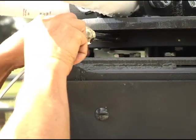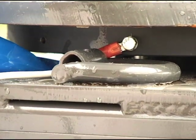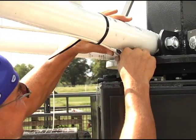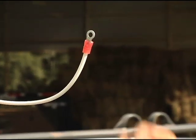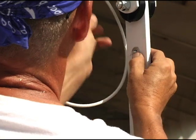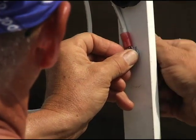The wire should be connected to the Nylatron ring located on the bottom side of the horse walker tree using the ¼ inch by ½ inch bolt. Be sure to keep the wire snug against the arm to help it avoid being caught on any obstruction during the walker's operation. Attach the electric wire to the panel by placing the ¼ inch by ¾ inch bolts and nuts through the drilled hole on the inner drop-down arm strap, leaving enough slack for panel movement at the end. Continue running each wire to each panel until all panels are complete.